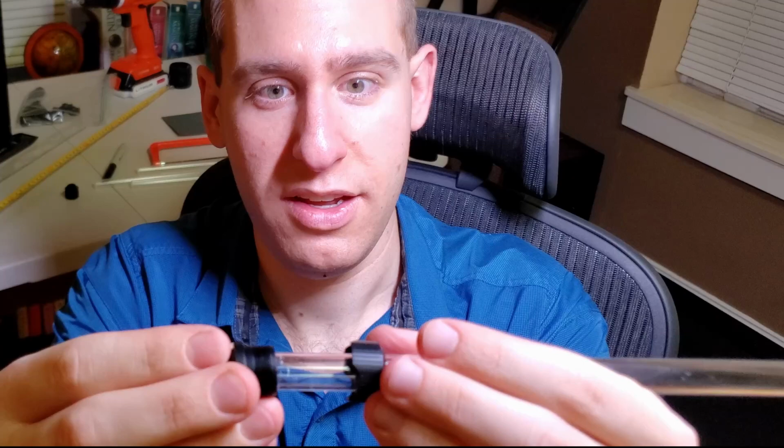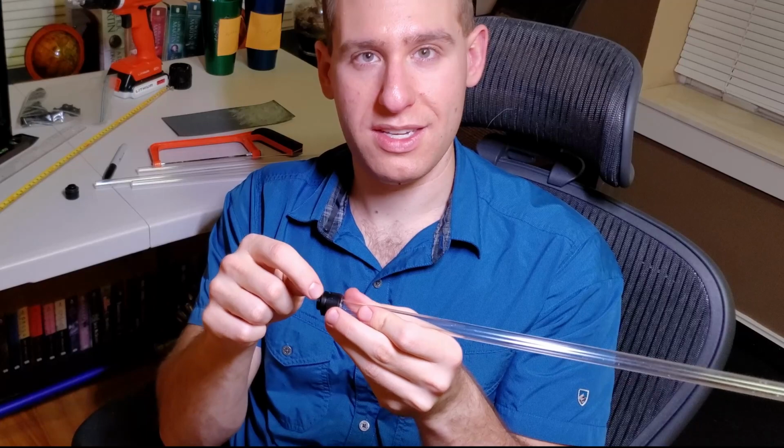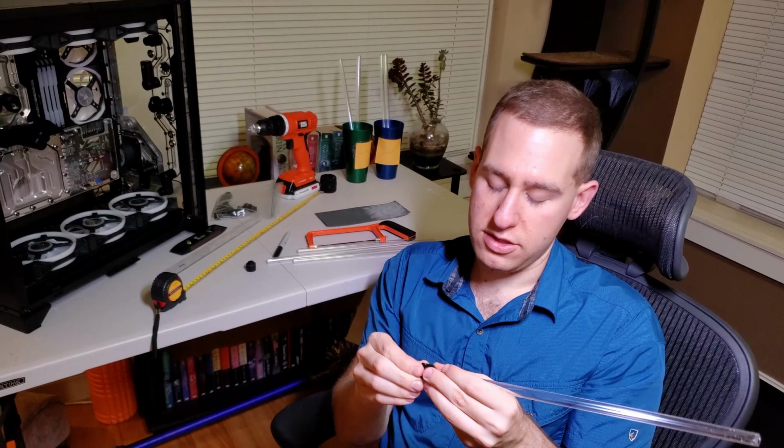It's not the easiest to do in front of you all without it being locked into something. Here, I'll just screw this end. But basically these then screw into each other. And there's nothing holding this thing in strongly. It's just kind of compressed, hence compression fitting, onto the fitting itself, and there's two O-rings, both the one that was inside that screw and the one that I had kind of rolled on here a moment ago. And I think that as long as your tube is hitting both of those compression fittings and you're getting a good seal that way, then you should be good.